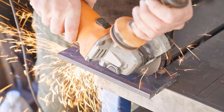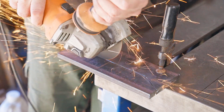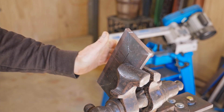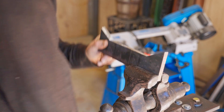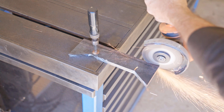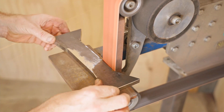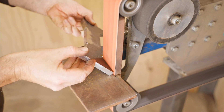I'm going to try and make the body of the axe. Because the axe will have a beard, I've left some extra material on the ends — I'm guessing how much I need, so we'll have to see how that goes. These grooves will be to easily locate them when I come to forge the shoulders and to make sure that they're in the right position.